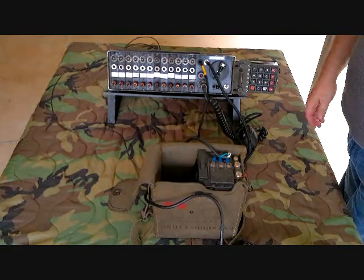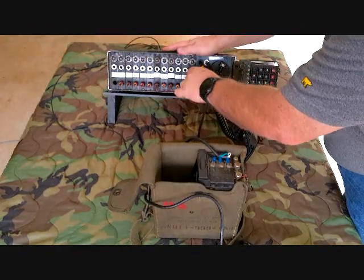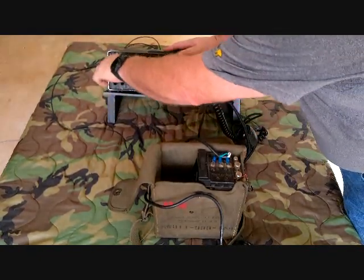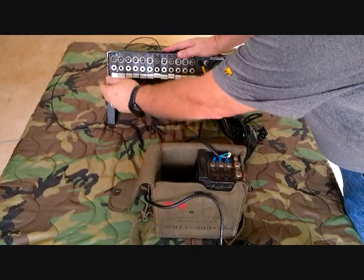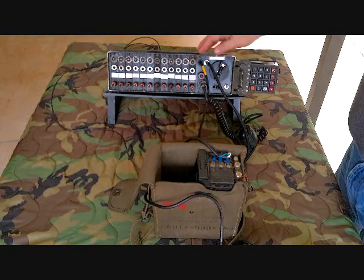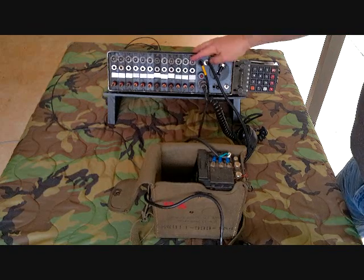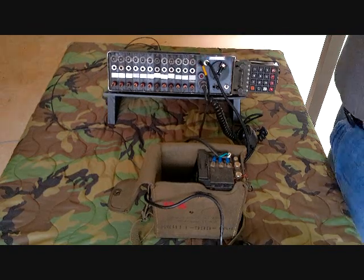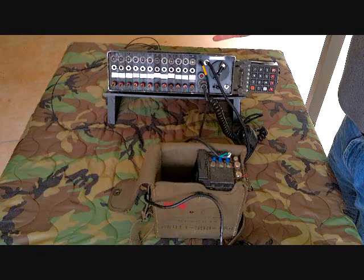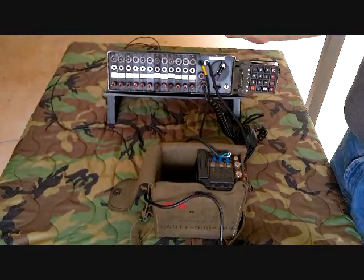It's also possible to bring another party in — you could just patch in. If you had one guy like this and somebody else wanted to come in on the call, you just go ahead and plug them in. You could bring multiple parties in. The trunk card will also operate on a non-dial tone switch. If you hooked up and took it off hook, it would show a light on the operator console indicating the trunk line is off hook, though you do get a little problem with false rings. And that's pretty much how it works — pretty basic, pretty durable and sturdy.